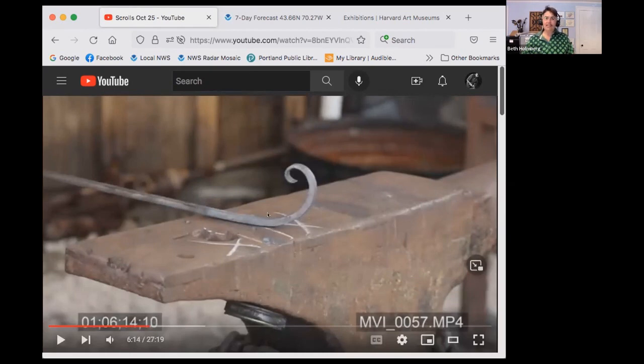I'm feeling like this is too big a space in here. So I'm definitely going to want to tighten that, which means this section here needs to be bent tighter. But you really want to make sure that you focused on that first half turn to three quarters of a turn at the beginning. It's almost impossible now for me to get a hammer in near the tip to change that, right? That's got to be good now because there's this bar in the way. So work your way out from the center, get the first three quarters of a turn really nice, and then work further on.